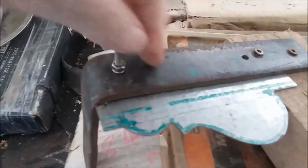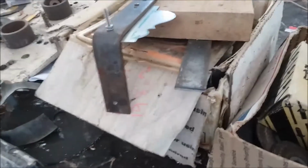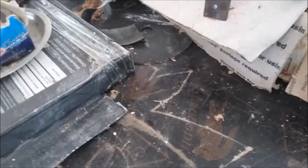Anyway, this piece is going to have a piece of wood up here at the top, and it'll drag along the top curved edge of this form, and it'll make that shape. It takes about 3 passes to do it. It won't be the first time you throw the concrete in. And the bottom of it, we have some thin plywood, but you can put cardboard or whatever you want in the bottom.